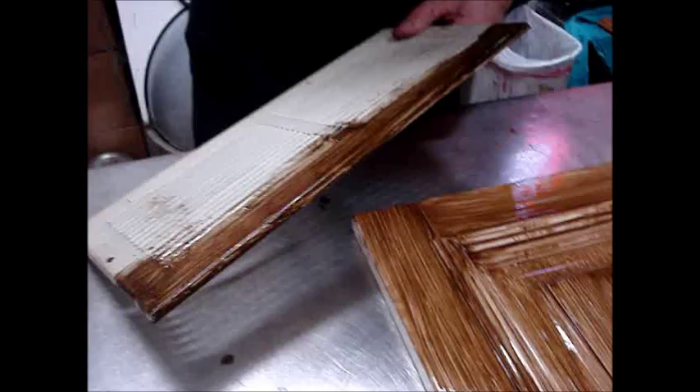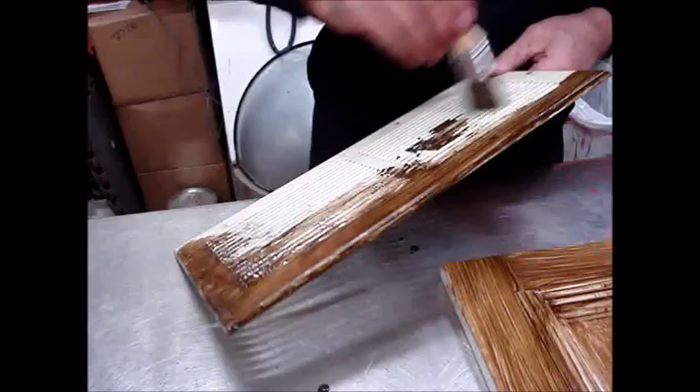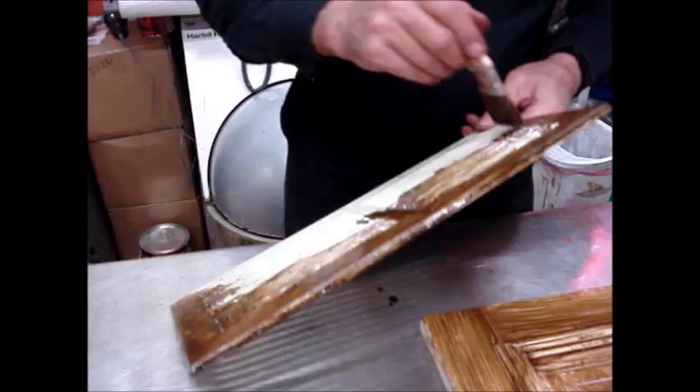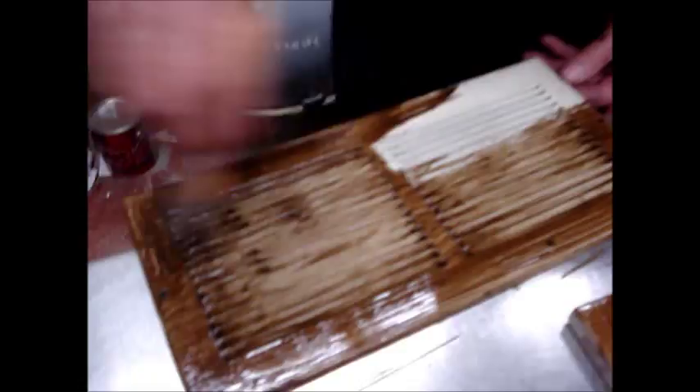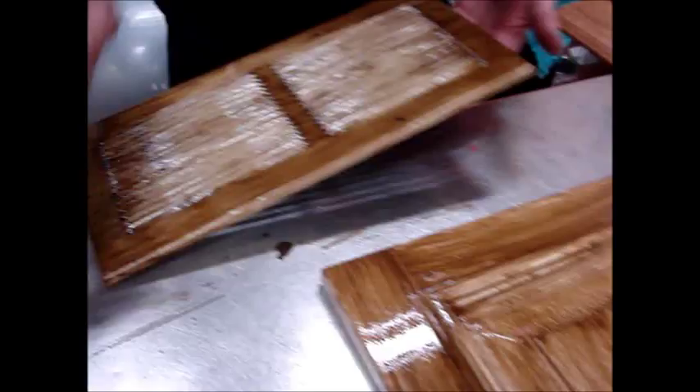You had to get very close, especially after it's on the wall surrounded by other wood and other stuff. This stain is oil-based, so you need to have a little bit of paint thinner around to clean up. Now this is going to take all night to dry, but I can add another light coat in about an hour. After this is all done, you put a satin varnish or polyurethane on it, which gives it durability, washability, and evens up the shine.